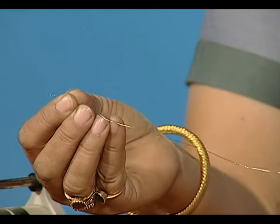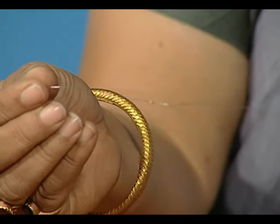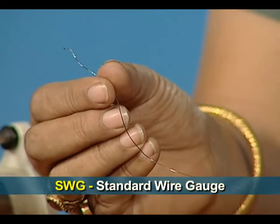Important circuit elements are resistances. These are used in the lab and you will have to recognize them because their functions are different. The commonest resistance used is a wired one — a shiny wire made out of an alloy called nichrome. The material is chosen because it does not change its resistance with temperature and can sustain the current steadily. These wires are made with uniform cross section, meaning they are homogeneous in material as well as in diameter. The wire is sold by standard wire gauge, commonly known as SWG, which depends upon the thickness of the wire — that means the diameter.